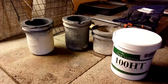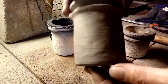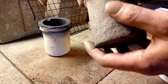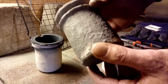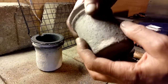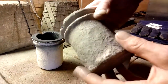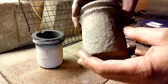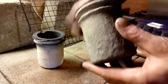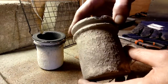I've got about three pours on some of these. This one here I put two coatings on and I've done two or three pours in it. After I pulled it out of the furnace there's no black on it — no black comes off — so it's getting no deterioration at all on the outside. You still get a little bit on the inside from all the heat, but you can tell this stuff is hard as a rock. It's a ceramic coating for sure.